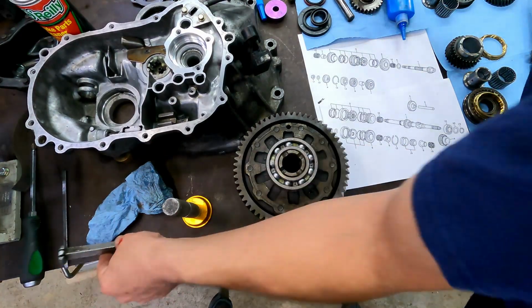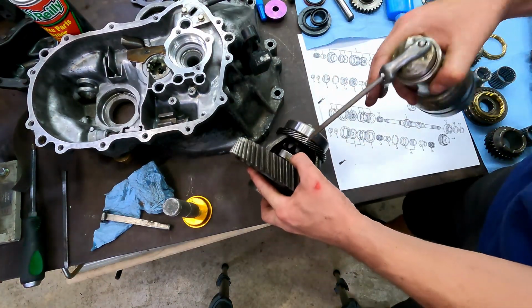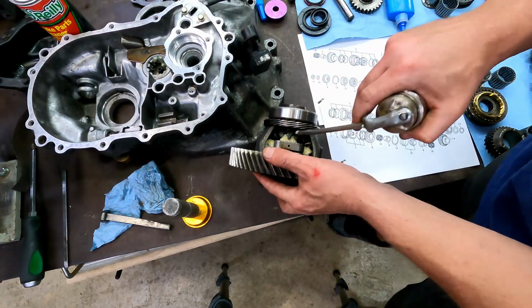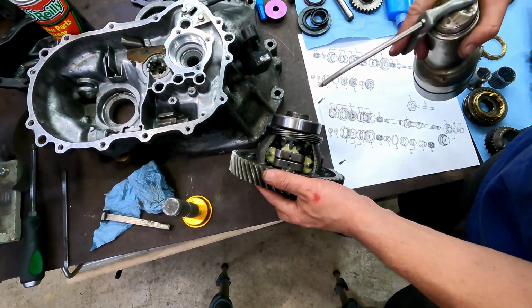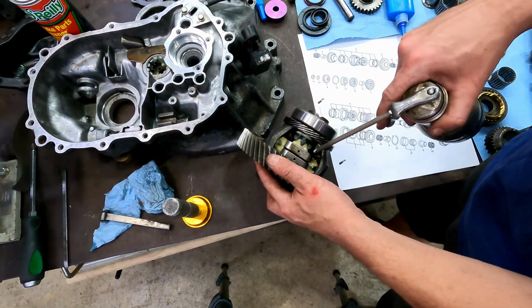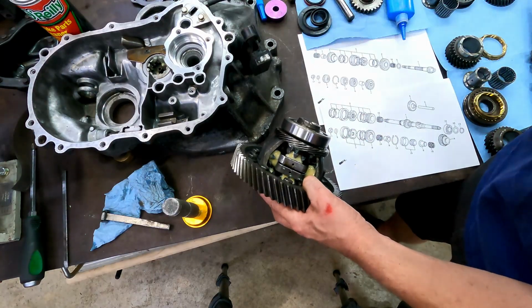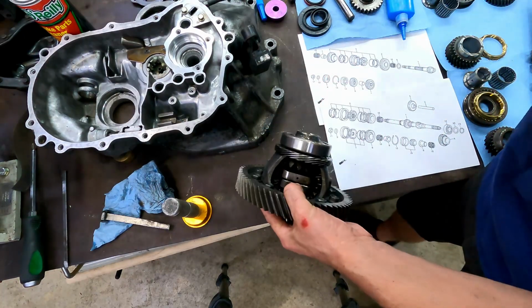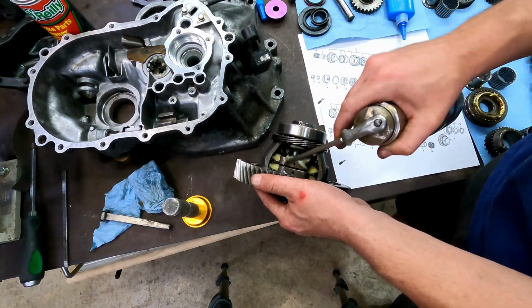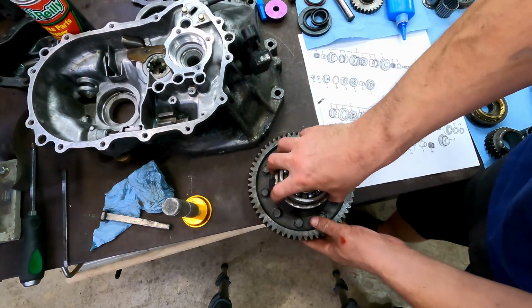That's down. I also want to pre-lube the differential gears because, after washing all of these parts, there's no lubricant inside. I would disassemble this ordinarily to do this and inspect these gears further, but this unit has a spring-loaded internal locker that takes a set of pins to lock it back together, and you have to fight the springs and everything. It's just not worth it. I looked through there with a good light. All the gears are in good shape. Everything does what it's supposed to. We're just going to put it back together. I looked through in here and looked at the splines as well. They're in good shape. Okay.